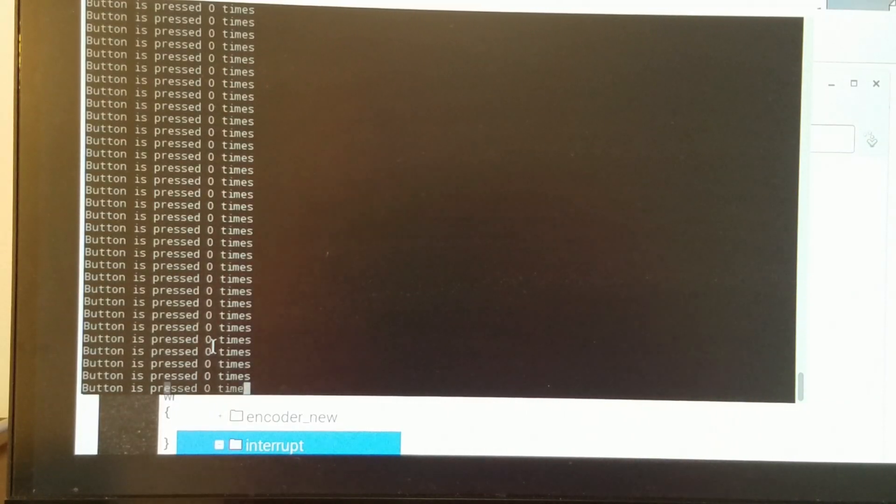I have created a code that counts how many times the button is being pressed. I have to mention that here I am not using the digital read function — I am using interrupts to detect when the button is being pressed. This is a very important and efficient way of detecting events, since you save processor time; interrupts are only activated when something happens.